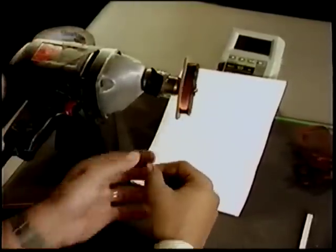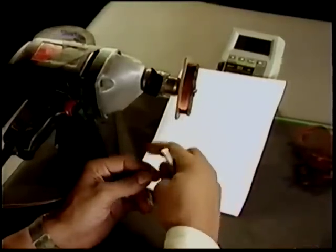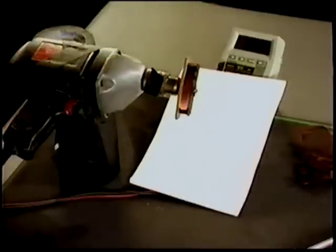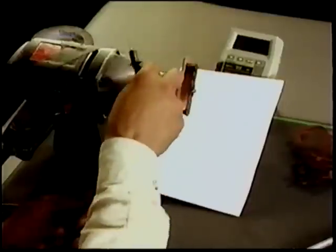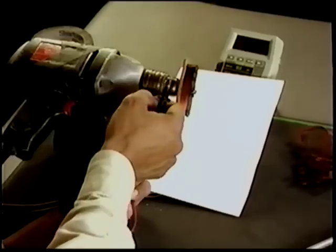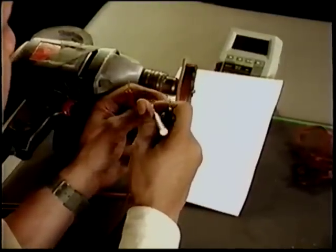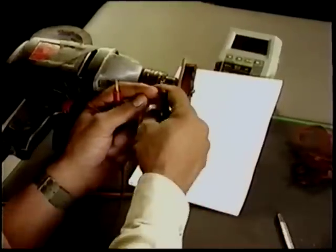When you get to the point that visually it looks fat enough, or kind of like the old coil looked, you have to test it right here. We're going to scrape a little bit of wire. Okay. Should be marked just by the fact that you were scraping right there. We'll take our first layer, scrape there as well. You can always take off, but you can never add. Once you cut that coil, forget about it.